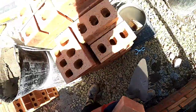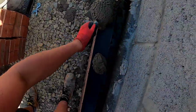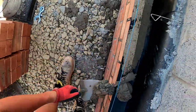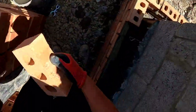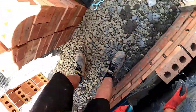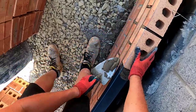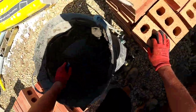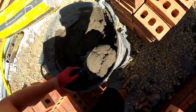When it comes to full fill insulation — I use this little insulation knife. I love this full fill insulation, it's so much easier to build with. There's no leaving bricks out everywhere. It arguably makes a more complete house, because obviously when you're blowing insulation in there are going to be voids. I've seen it — I've opened cavities up when it's been blown in and it all settles with massive voids in it. It just isn't as good as full fill.